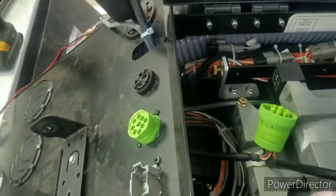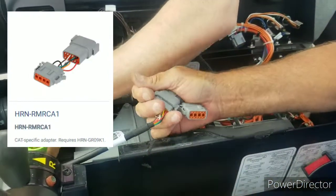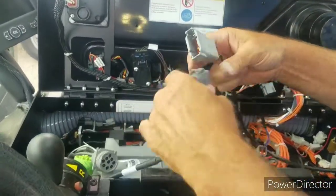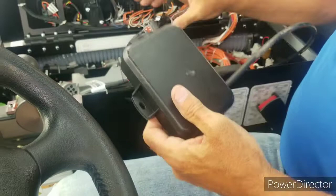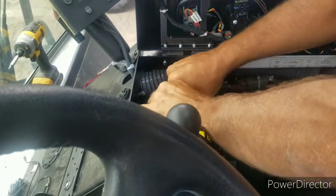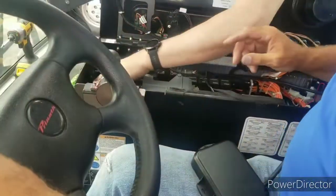The 9-pin connector is now nicely put in and comes through the back. We've got our extra harness — that's the Caterpillar gender mapping harness — because Caterpillar has a slightly different pinout than regular, so we have to put that in to make it work for the vehicle. Jim's got the GoRugged device and it just plugs right in, then you plug in the other side — the native port from the vehicle. We just turned the key on and the device started to beep, and we'll start to see our indicator lights come to life on the GoRugged device.